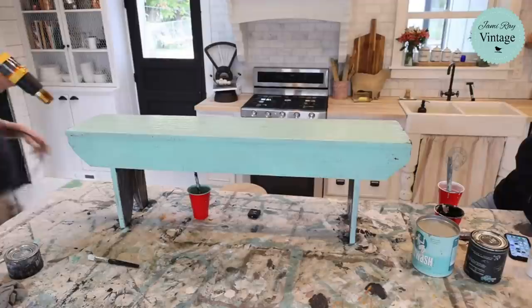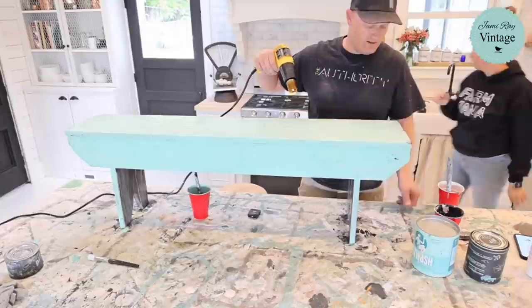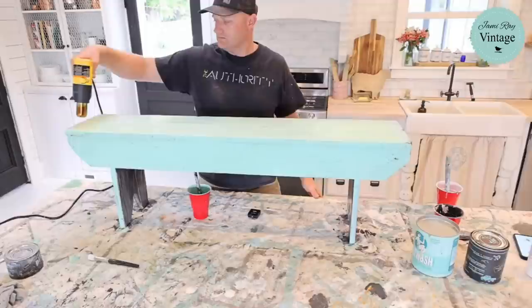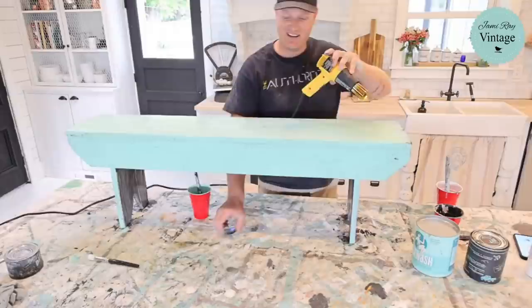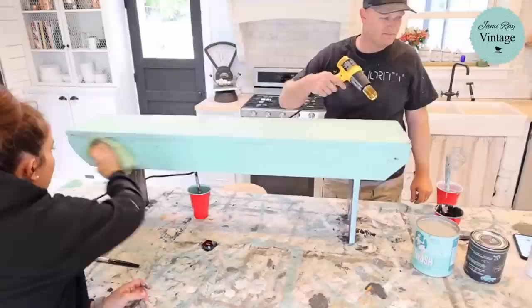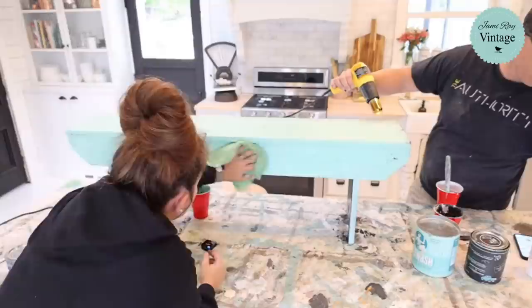The front is ready for distressing. I'm going to try not to keep sandpaper in the house now that I just painted — never say never though. I've got some really good crackle. This is just water on it — it reactivates the milk paint and also distresses it, so we're going to get more chippy and crackle happening.